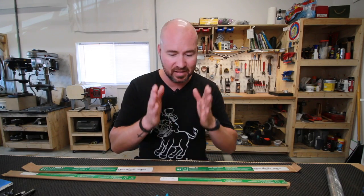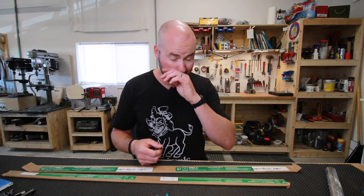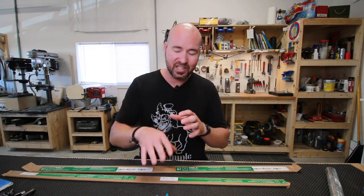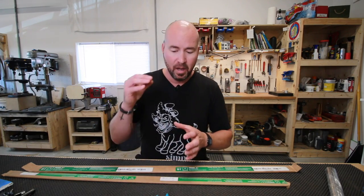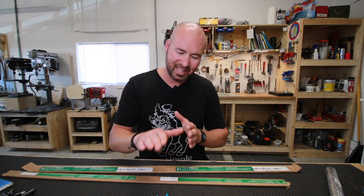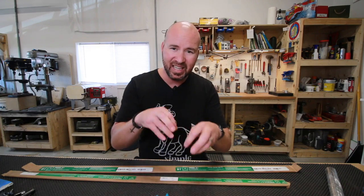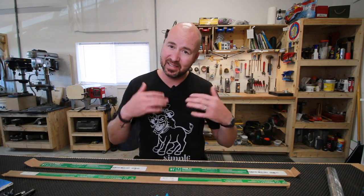But ultimately, I'm not saying this is law, this is how it is, but decarburization exists. You think about your welder. If you've got a MIG welder, the proper gas shielded MIG welder, not flux core, that gas shielding, it's using argon, or I think mine uses carbon dioxide, I don't know what it is, but it's not argon. Anyway, you're purging that weld area and getting rid of the oxygen so that the liquid metal can cool properly without being eaten away and destroyed by the oxygen. Now, obviously a welding temperature is significantly higher than an austenitizing temperature for these steels, but it's the same principle.